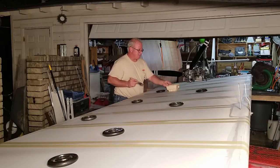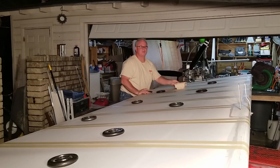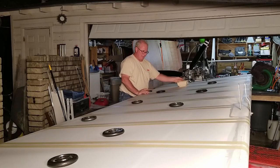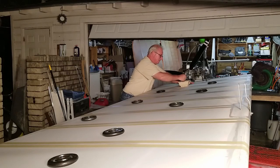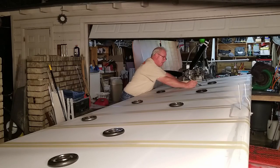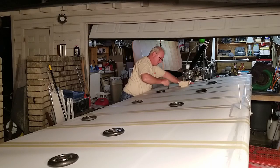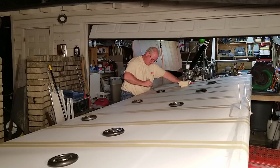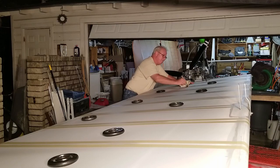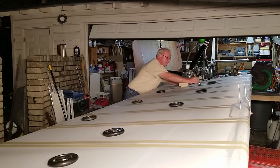Now this rib gluing here is in lieu of something like rivets or rib stitching. This airplane is not a fast airplane, definitely below 100 miles an hour, so according to the instructions for the glue, not the instructions for the airplane, the glue joint is sufficient for a sub 100 mile an hour airplane.